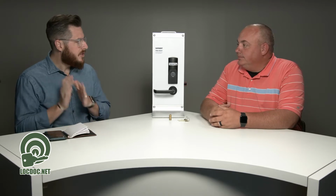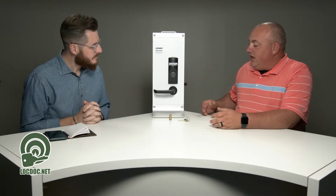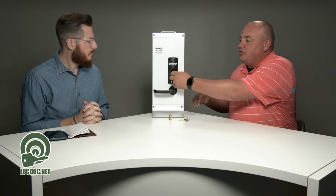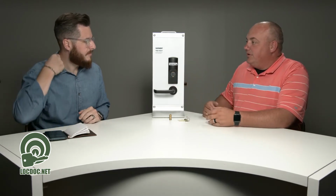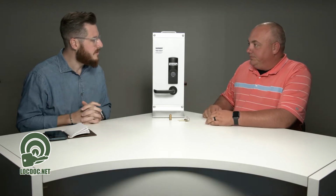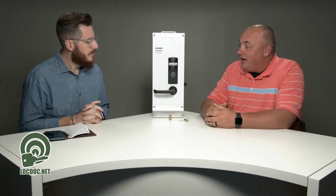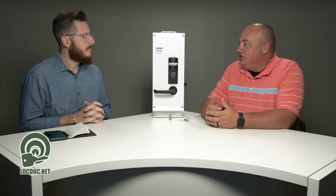So what is the traditional method of changing out the key on a door? So the traditional method, if it was this lock here, you've got to take a couple of screws off the side, take a faceplate off, take an internal screw loose, unscrew this cylinder. There's a lot that goes into it. Most of the time you need a locksmith or somebody that's qualified to do all of that. So partial disassembly of the lock. Depending on the lock, it can become much more disassembly of the lock. On this particular one, it's probably one of the easier ones to change the cylinder out.